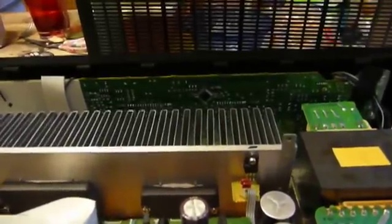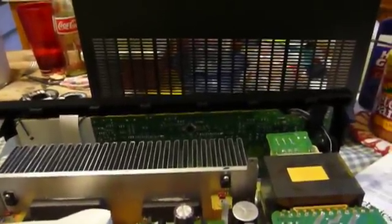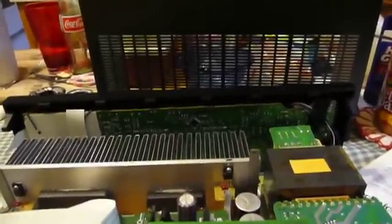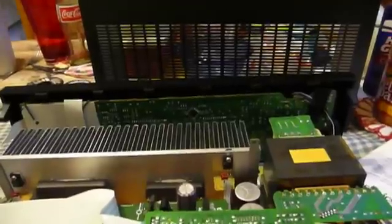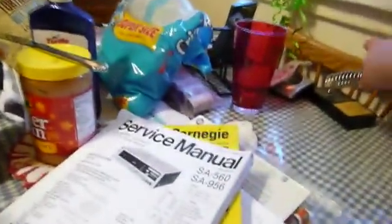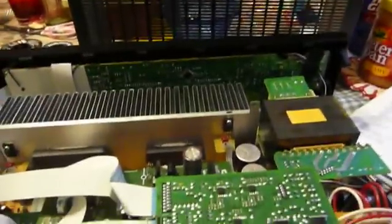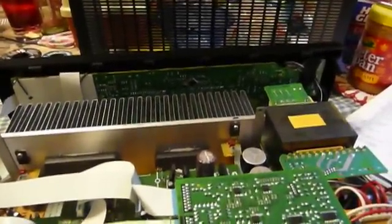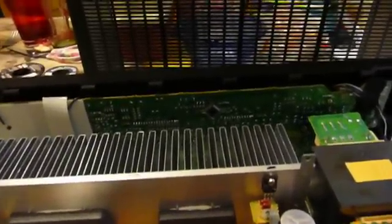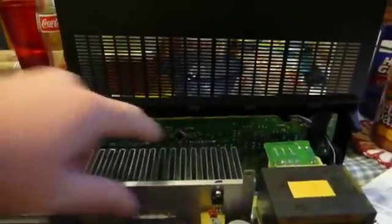The reason I wasn't very encouraged was because the display chip is not through-hole soldered — that is to say, a leg of the component does not come through the circuit board and fill a hole with solder to make the electrical connection. Instead it's surface soldered, meaning it's only soldered to the top of the board. I'm not really equipped to do surface soldering; all I've got is a cheap Radio Shack 15-watt soldering pencil iron without a terribly fine tip. But for my first attempt at surface soldering ever, I was actually talking on the phone at the same time, and I just carefully touched each pin on this chip just enough to heat it up and kind of re-secure it to the board.